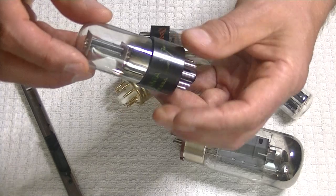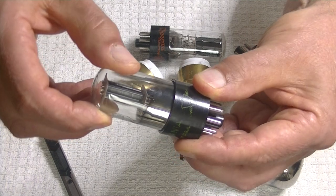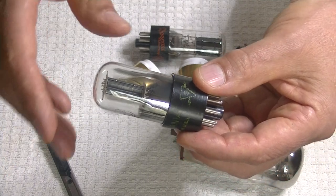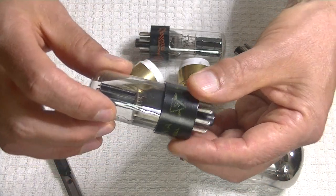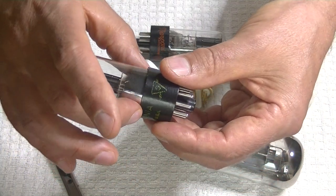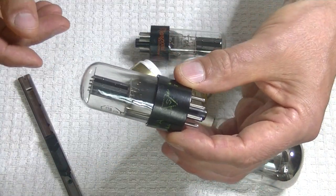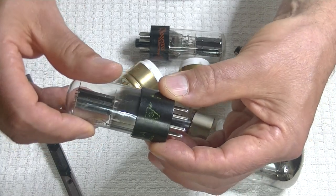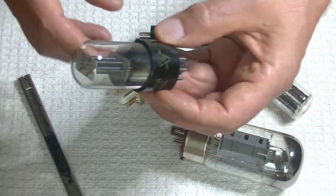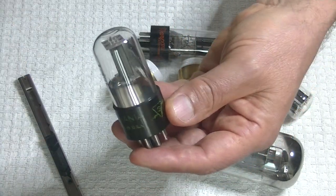So, how do we go about it, and when do we have to glue tubes? Take a look — you can hear that? It's a little loose. You could leave this; it would be perfectly fine. What we're really concerned about is a complete looseness in which the electrical wires — the connections from the glass to the pins — can actually move a fair amount. You can wreck your tube really quick if you have a loose tube like that. It can be dangerous; you can have a dead short. So don't use a tube like that. Fix it, then test it to make sure it's working properly.